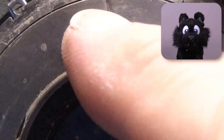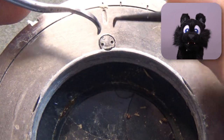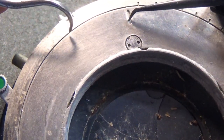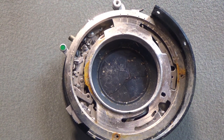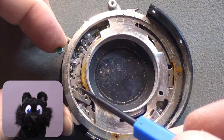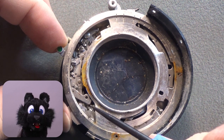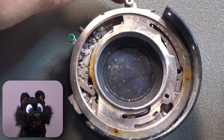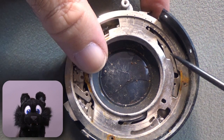Let's get into the shutter next. The front plate is held in place with a tiny rotary clasp. Turning it 180 degrees releases the plate and allows it to be rotated and removed. Lots of grinding noises turning it to the other side — but at least it moves. That is rust inside! Not a good sign at all! A few parts are still moving, but overall it's completely and utterly stuck. I am carefully poking all the springs to see if any will fly out when I remove the timing selection disk. You can see the cams on both sides that control the timing and shutter control functions based on the rotation angle.